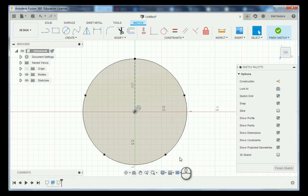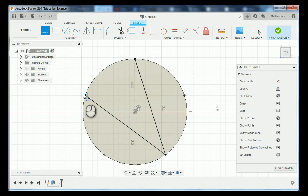Now that we have our star, we're going to right click, press and pull. We're going to select the surrounding area — make sure you're not selecting the star but you are selecting the surrounding area. We're going to subtract 375 thousandths and then press enter.